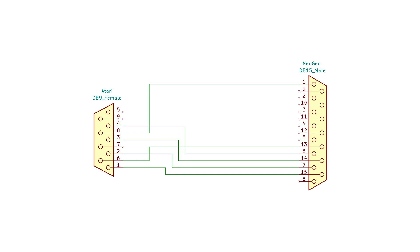As the Atari joystick only originally had one button, I'll leave a lot of the buttons on the Neo Geo stick unused, unless you want to connect all of them up to pin 6 of the Atari connector with some small jumper wires — but I didn't bother.